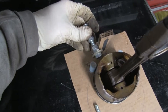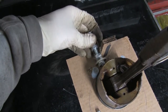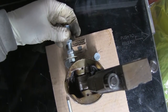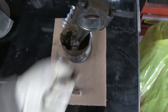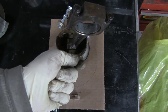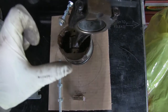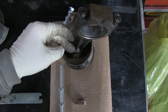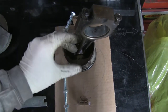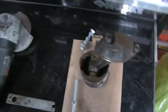That little nut falls right in the middle of it. So what you then do is you will set this — once it's all made — to the proper height in that slot, lock it down, and you will set your depth. And what that's going to do is when I heat that connecting rod and shove that wrist pin through, it gives me a positive stop. So all I've got to do is focus on getting it through there as fast as possible and then hold it there. This will start to heat the pin and they will lock together, and then that's done and I'll go on to the next one.